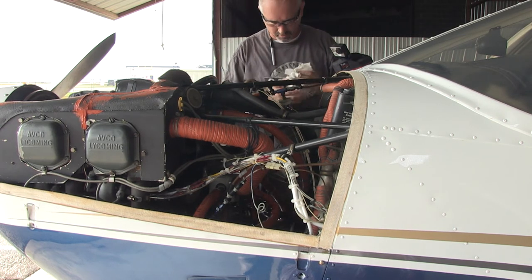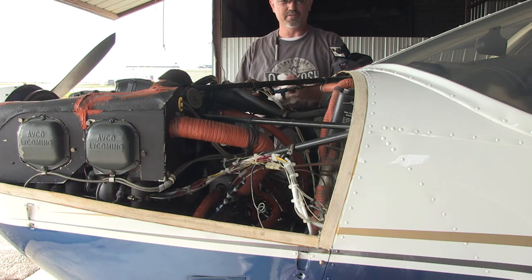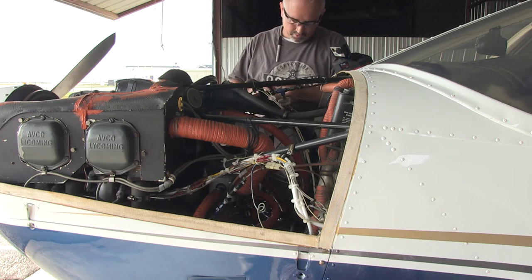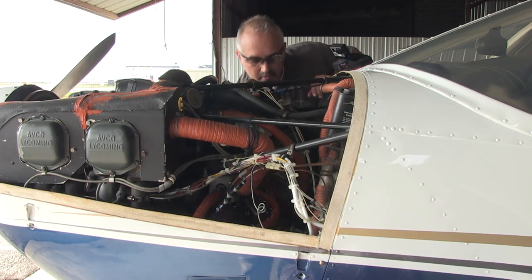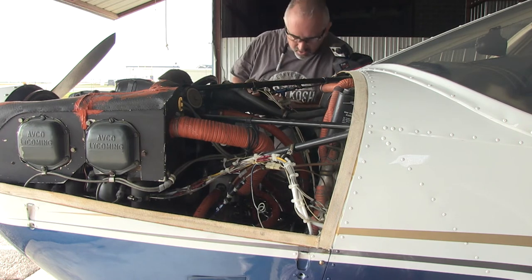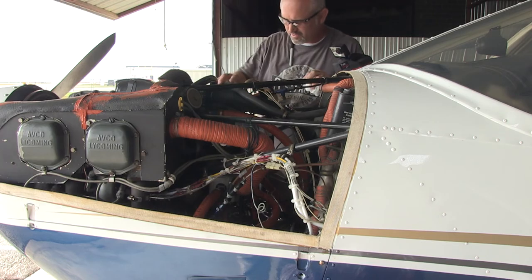We've got a few spins on the safety wire, and we'll spin it again on the back side, then cut it. Right now it's attached to the tab on the engine block with about two to three inches hanging off. Cut the excess safety wire, and make sure we bend it back so we're not poking any wires or anybody working on the airplane — it doesn't make mechanics happy to get poked. Bend it back on itself and squeeze it tight. You want everything under the cowling to be nice and clean so if there's any issues you can spot them quickly.